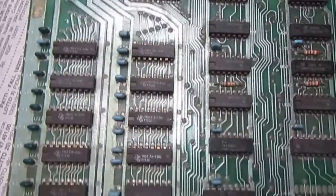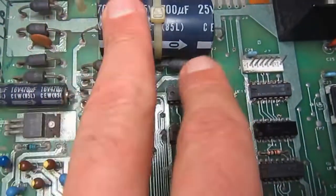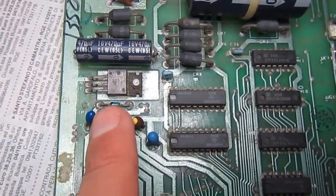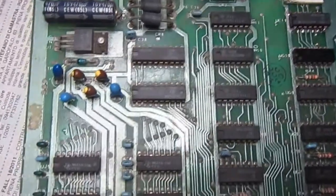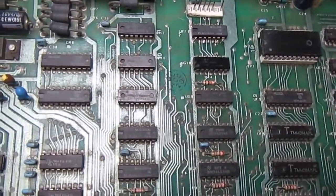I started to clean the motherboard. The next checks will be every diode and a few transistors. I will check them with the multimeter, then check electrolytic capacitors to see if they are good or shorted. I'll also check for shorts on the rails - I can see many tantalum capacitors which could be shorted. Then I will see if there are any shorts on the power rails and try to power up the power supply to verify correct voltages are produced.